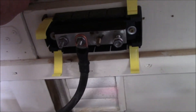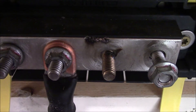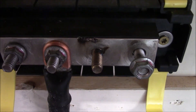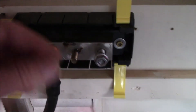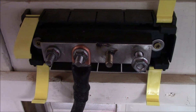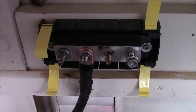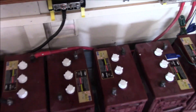Look at the arc-over point right there. You know why it was doing that? Because I only had this thing finger-tight. You could actually move the cable — that's how frickin' loose it was. So stupid on my part. Glad I caught this before it blew up on me.